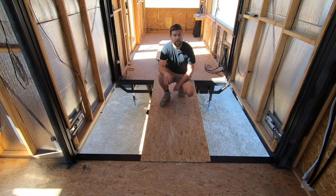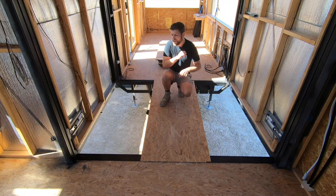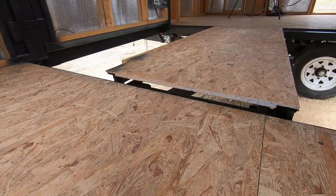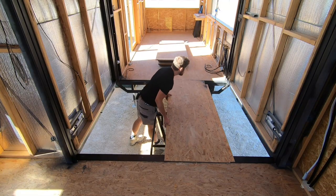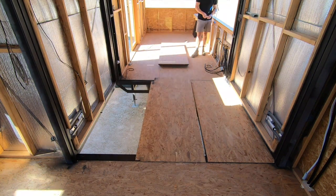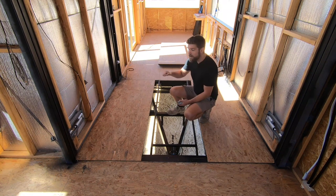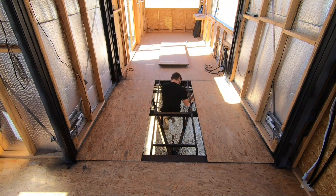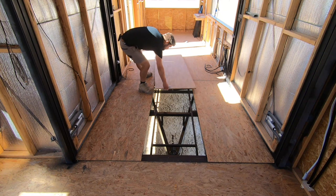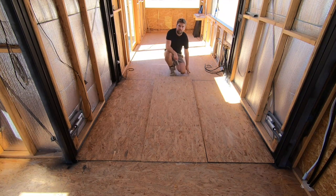With the rails for the lifter installed, I lift it up so it's level with the floor. I roll each panel across the floor straight onto the rails and down in between the trailers. With the panel between the trailers and sitting on the rails, I lower the lifter down, which supports the panel on both trailers, then slide it across into place. I then lift the lifter back up and repeat with the next panels. Before putting the last panel on, I get underneath and put the retaining springs on — these hold the panels down and pull them tight into the main trailer, ensuring a nice sharp line between the floor and the main trailer. I hook the spring onto the center panel before lowering it.